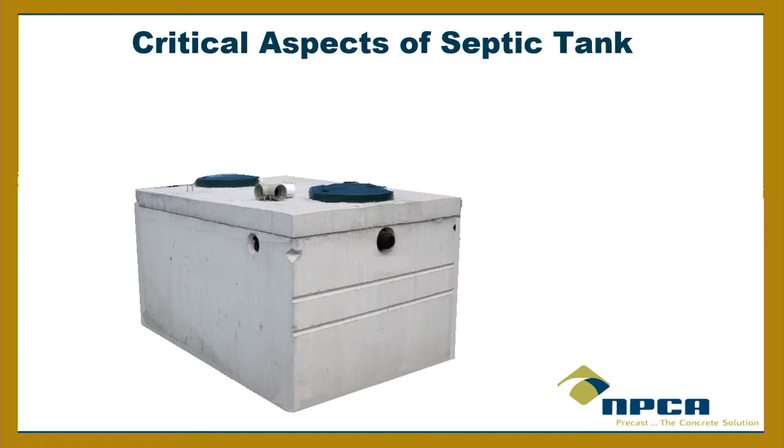That's the expectations. You were talking about strength earlier on, and the strength of the tank is the strength of the concrete to be able to withstand some of these loads, right? Because it's going to want to push in on the walls. So that strength is very critical to that performance, and we'll talk about that here in a little bit.